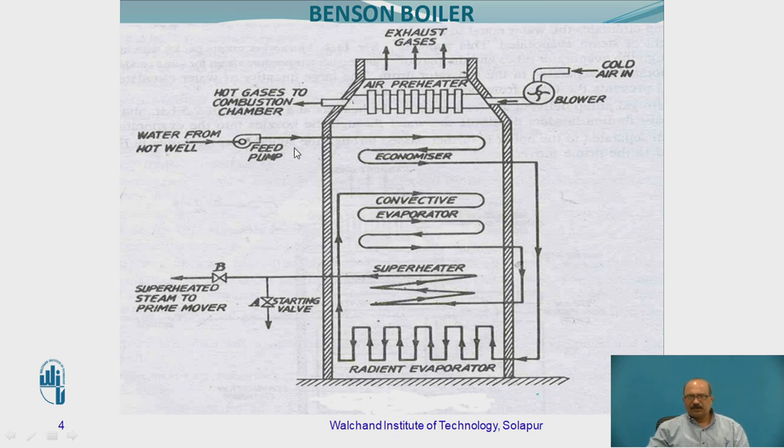So now the feed water comes to the economizer pipeline. The economizer gives additional heat energy to the water so that we can increase the temperature of the water, and that high pressure water is coming through. In these pipes, if there is water, bubbles may form inside the pipe. To avoid damage to the pipe as well as energy loss, we are going to be using the water at high pressure, so there will not be any bubble creation inside the pipe — it will be forced to flow to the next portion. So that will come to the radiant evaporator. In this particular combustion chamber, the first part of the energy is going to be utilized by the radiant evaporator. After utilizing the maximum part of the energy, it then comes to the next part — the convective evaporator.